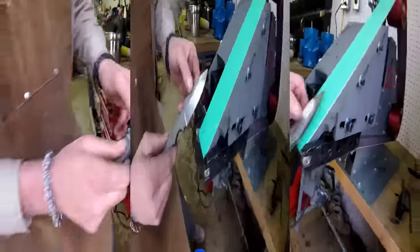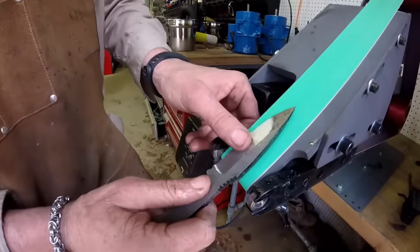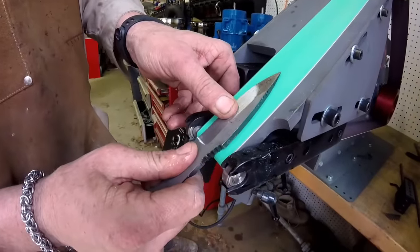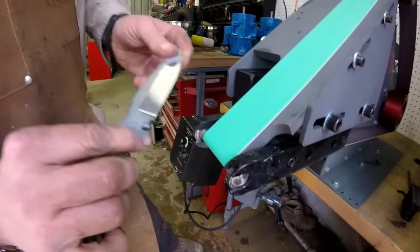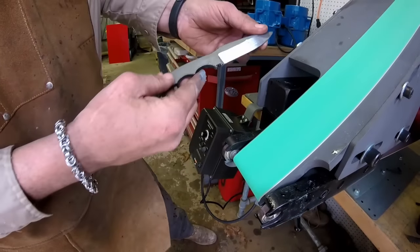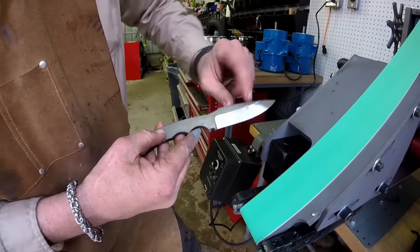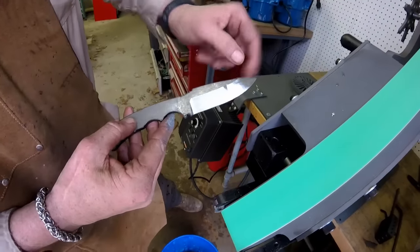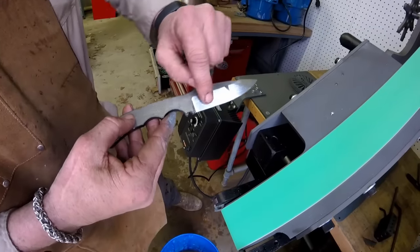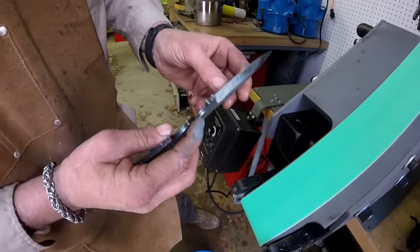I'm going to go move the other side. You can see it's starting to take the two-inch grind line out — not perfect yet. As you can see it's starting to try to take the two-inch grind line out; I've still got a little ways to go. It's taking all my scratches out that were going this way and making them go this way. I've almost got all the scratches out, and of course I still need to push my plunge further to the rear on both sides.